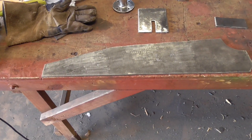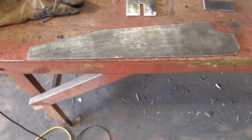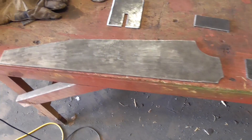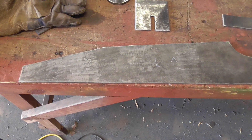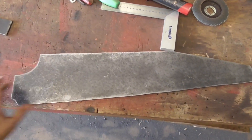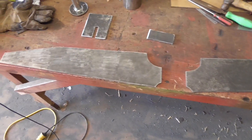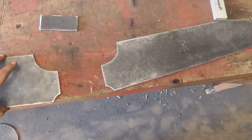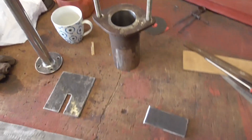Because I've got to move the rudder shaft and the skeg back 14 inches, we'll have to place another web stiffener right across that area there after I put the external doubler on. I've cut these plates out ready to go — these are basically the two web plates that will go inside the boat and span across the bottom of the hull.